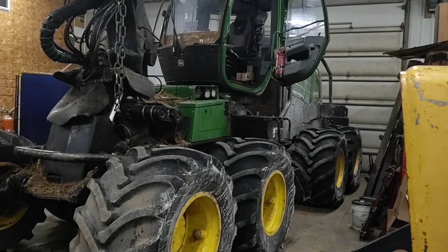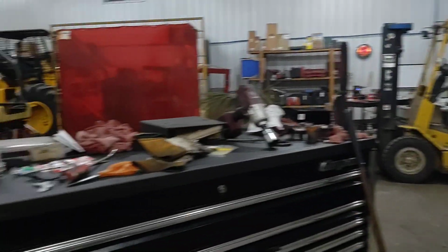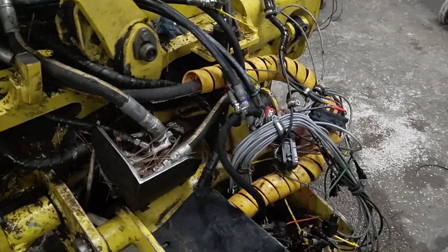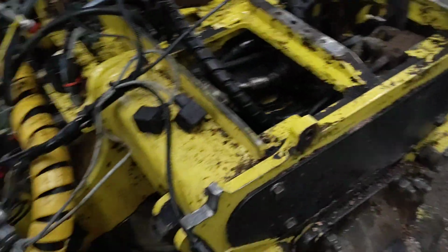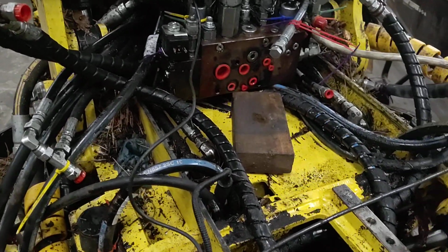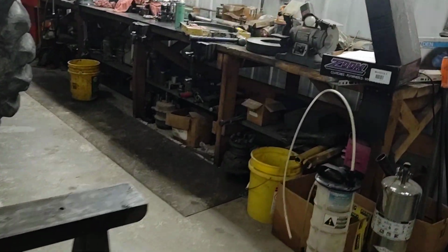He's a floor mopper. Anyways, somebody did ask me the other day, is that a 440G? Yeah, it's a 1270G. And there was a trail of oil coming in here because it was leaking all the way out of the oil into the head here. And look at the rat's nest to get at this valve bank. We'll move that. Oil everywhere. Wires everywhere. Sensors everywhere. So it was leaking somewhere on the valve bank between the valves and the sections, which aren't really sections. Well, it's kind of complicated, like everything is.